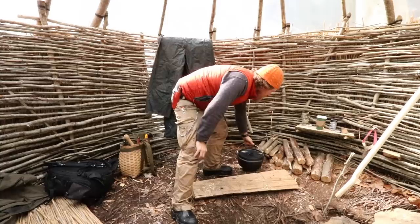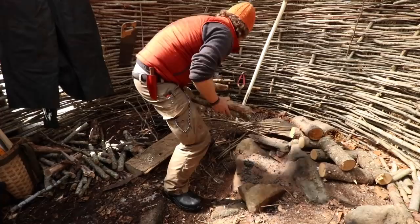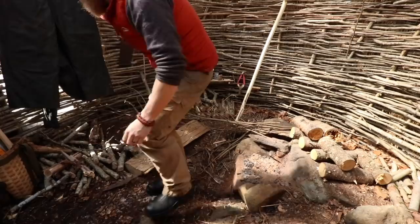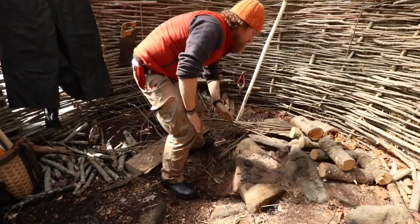All right. Replenished my wood pile. Good dry stuff here, good dry oak. The drier it is, the better it'll burn, the more BTUs and the less smoke you get out of it. And the harder the wood is too. This pine, since it doesn't draft that well in here, last time got kind of smoky. I figure I'll save that for when I fix the fireplace so it drafts better.